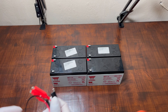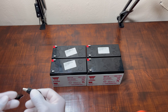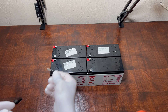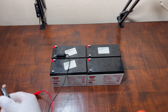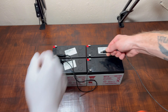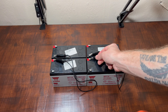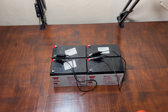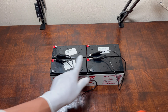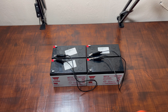As you can see in front, we have two batteries. We're connecting them in series — one with the black and the red. And the same thing for the rest of the batteries as well. So what that means is now we have two 24 volt groups. This connection is going to be 24 volt, and this one is also going to be 24 volt. Now, to make the parallel connection for that — to combine two 24 volt groups — we need to go side by side, as we said earlier.